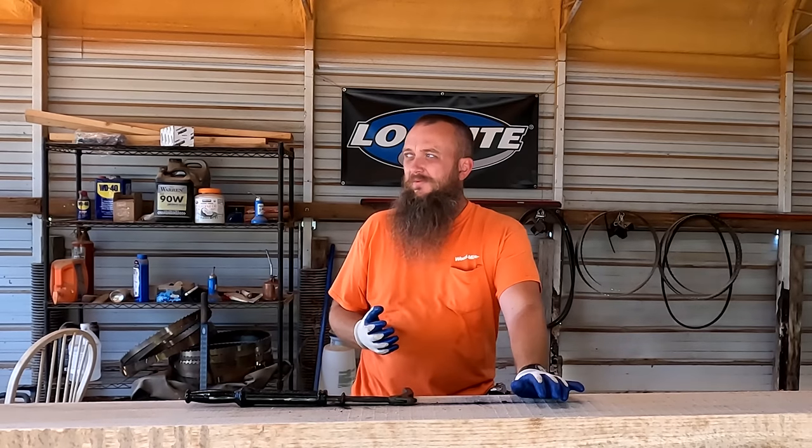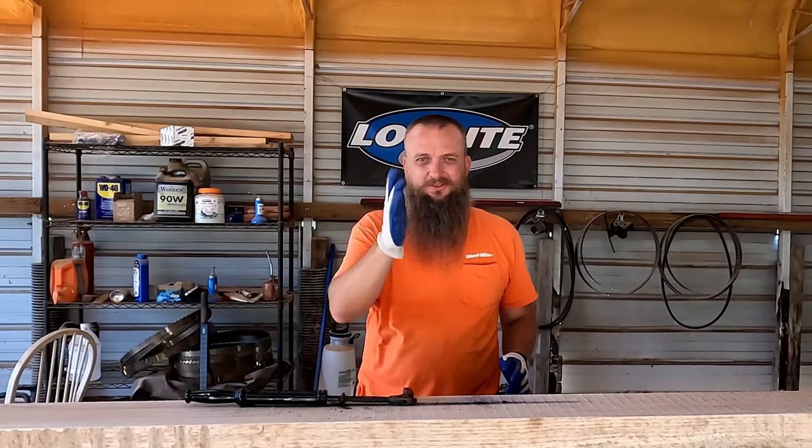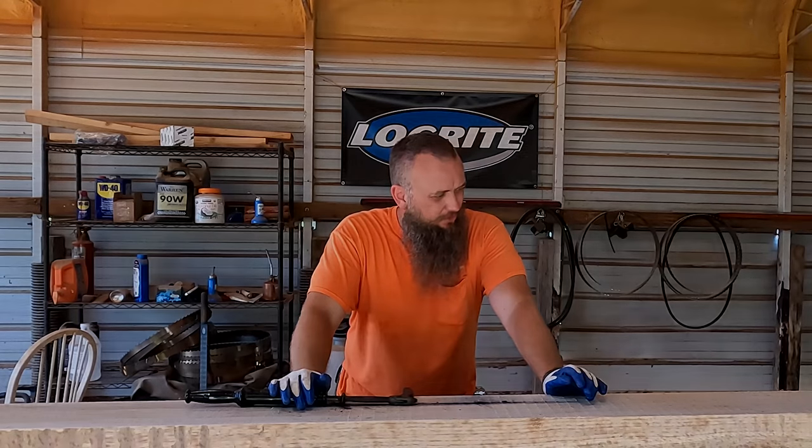And set is, how to describe a set of a blade, that's the degrees it is off of center. That creates your curve, so that's how much set you have in a blade. Usually about 23 to 25,000ths in these Silver Tip Turbo 7s. That's the usual set they have in them. But it doesn't ruin the blade.